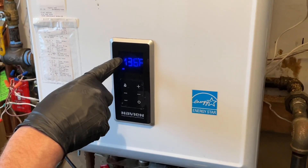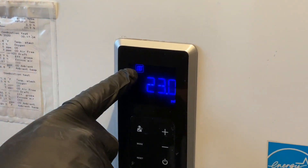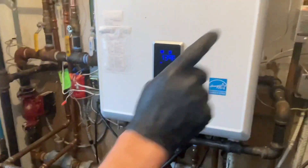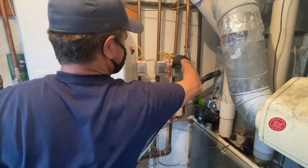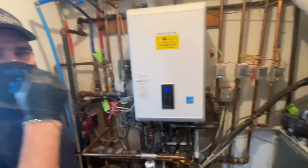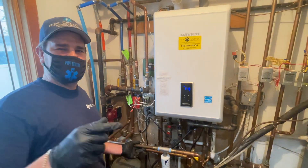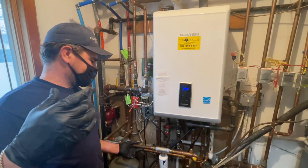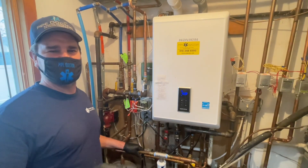Kelvin's doing that right now — as you can see it's getting power, that end switch is about to close, and we'll see a little radiator icon pop up. We already have it on the relay, and there we have it — we now have circulation to that zone. That zone valve is open; the other ones are closed. That's how you wire a Honeywell four-wire zone valve.